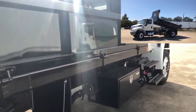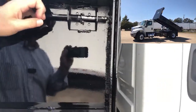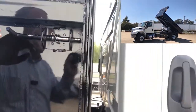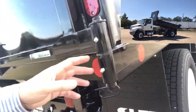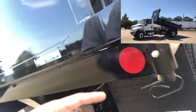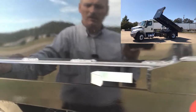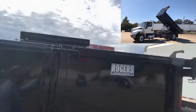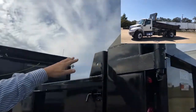These are fold-down sides with four heavy-duty hinge points. The pin that holds it in is the type that allows a safe pull-away, so you don't have to fight the hinge point as you do the latch and unlatch, and it will pop back in when released. The fittings on the hinge points provide grease points for upper and lower hinge pins and upper and lower barn door pins. The safety hooks are for tying down the pole strap that you have for the tarping, and up on the top is the dog-ear hook that will connect with the pole as you pull it to the back.